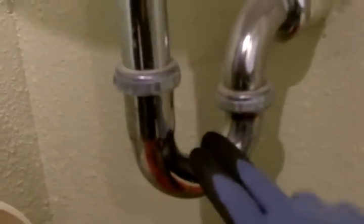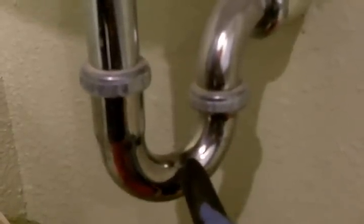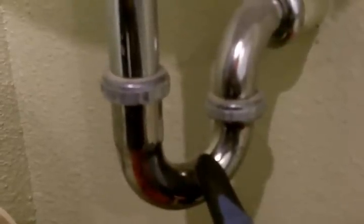The water moves around, and the reason for that is so that you can have a trap. What's a trap? Let me show you on a sink first. I want to show you the P-trap on a sink — that's what this is. This P-trap is no different than the trap that's in your toilet. It's filled with water and it serves two purposes, but the most important purpose is it prevents gas from coming back in from the sewer into your house. It's for safety reasons. And you've got this same trap on a commode.